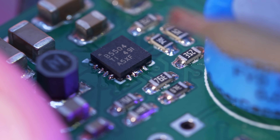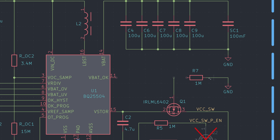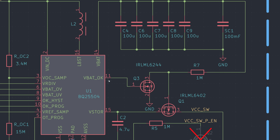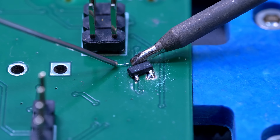It's a good idea at this point to do an ocular pat down after your reflow, so you can catch any bridged pads and fix them before powering up. It also gives you the chance to rectify mistakes — like thinking a trigger signal was active low instead of active high — now having to invert the signal for the high side switch it's supposed to trigger. Find a place to fit those extra components on the board, and continue on like nobody saw.